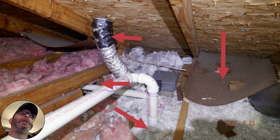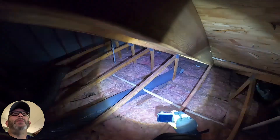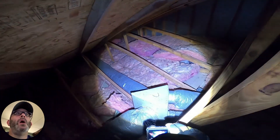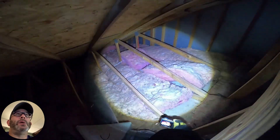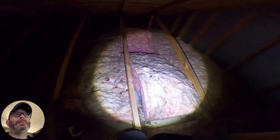I wanted to get you on top of your master bedroom. As I mentioned when I was out there, there was some insulation that was just kind of bunched up and missing. I went all the way over and you're going to see where the insulation — first off, you need more. We want to be R-30, and right now it's about five to six inches at an R-value of two, so you're about R-12. You're about halfway there, but the insulation is just slipping down and bunched up. And I don't know what happened along the way — maybe somebody added a recessed light or they just got lazy — but they just put the insulation over top of that recessed light, and that's just not going to work.